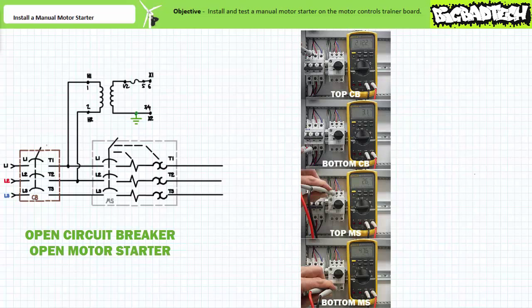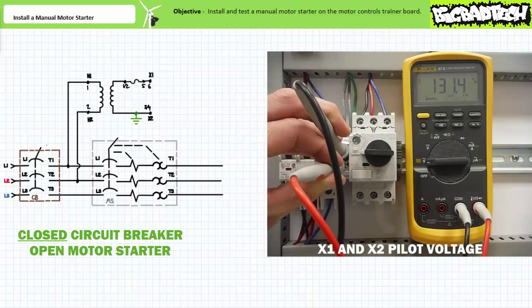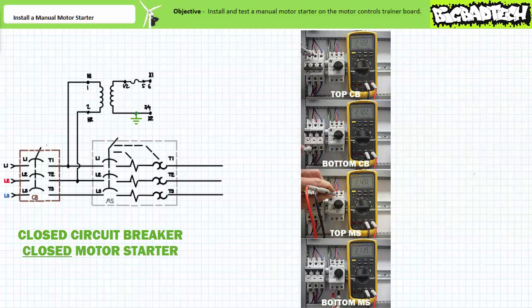When the plug is unlocked and inserted and both the circuit breaker and motor starter are open, a DMM in AC voltmeter mode indicates only the top of the open circuit breaker is hot as expected. The bottom of the circuit breaker, the top of the motor starter, and the bottom of the motor starter are cold as expected — there is still an open in the path. When the circuit breaker is closed, the DMM indicates both the primary and the top of the motor starter are hot as expected, but there is still an open in its path. With the motor starter also closed, the DMM indicates both the primary and secondary sides of the control transformer are powered up as expected, allowing a level of functional isolation.